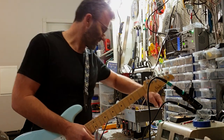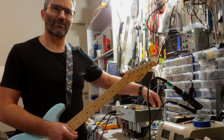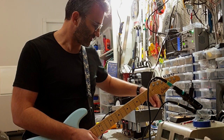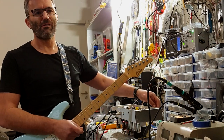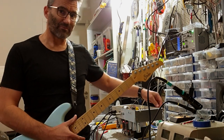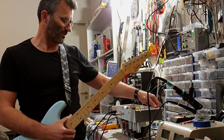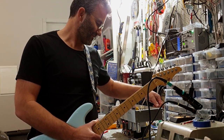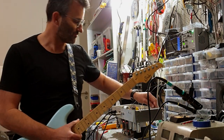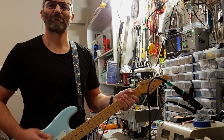Position. It is a 3K3 resistor with a 0.68 microfarad bypass cap in parallel with the 10K. So it basically gives you a 2K7 with a 0.68 bypass, which is exactly the same as the first cathode, right? So this is your kind of classic cascaded 2K7, 0.68 microfarad cathodes. Very common in a hot rod Marshall. Here we go, and let's try.